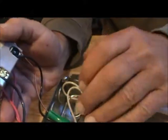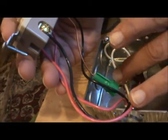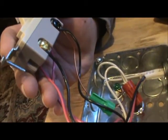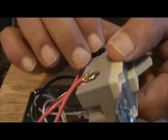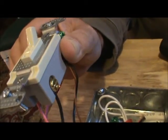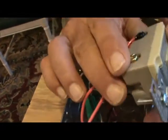Then it comes over to your four-way switch. Your white wires go together again, your bond wires connect together and go to your switch. Your black and red wire from your three-way switch goes to the two dark screws on the four-way switch — they're going to be on opposite sides of each other. Then going to your other three-way switch is going to be your other red and black wire, on the brass screws.